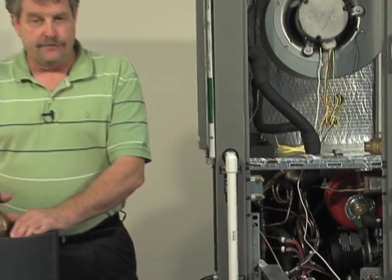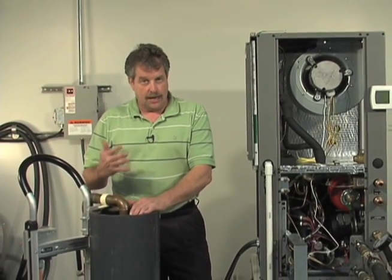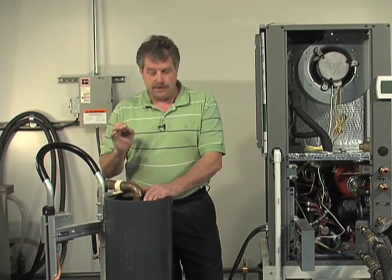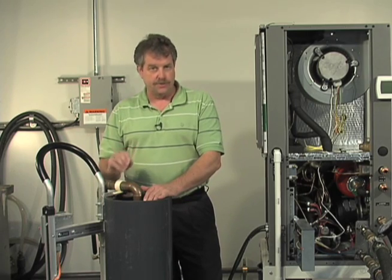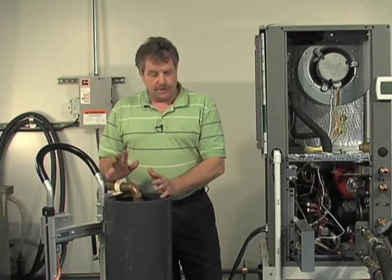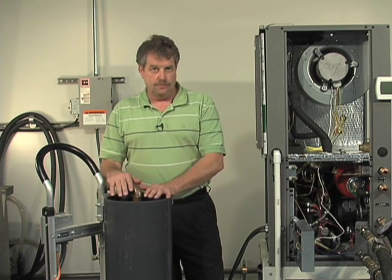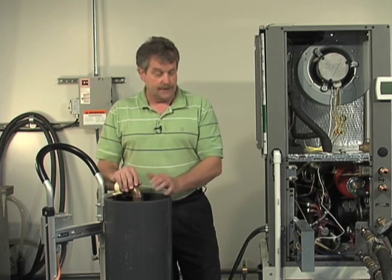Again, this would be that point in time. If you're introducing antifreeze, you rotate those flushing valves inside the machine and introduce your antifreeze. And always, if you're adding antifreeze, you do the antifreeze level check. Make sure you have the concentration and freeze protection level that you need. We're getting ready to go ahead and pressurize the system again. This is a video that's covering a pressurized loop. We're going to have some others down the path here about some non-pressurized.